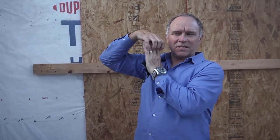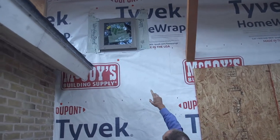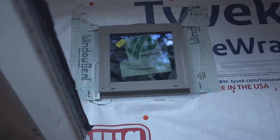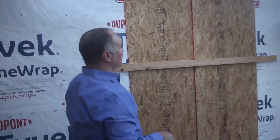And that counter flashing gets attached into the brick, and it pulls all those tight. You can see how we're using a flex seal on the bottom of the windows — that's a flexible seal at the bottom, then a three-sided flashing, and the Tyvek is wrapped over the last flashing and taped. That is the way you seal a window.